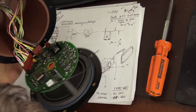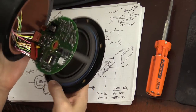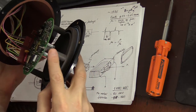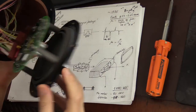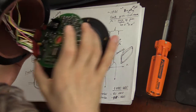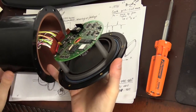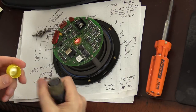The unit is hermetically sealed — you can see the rubber seal around the body, which is made of plastic, and possibly even magnesium. It has a matte gray paint finish. There are two separate connectors — one for power supply and one for signal. Inside there are two connectors; let me disconnect them. They go into a rather nice military-spec connector — Bendix 9629, with what I believe is 14 signal lines and one ground, labeled 1415.